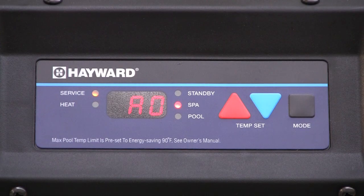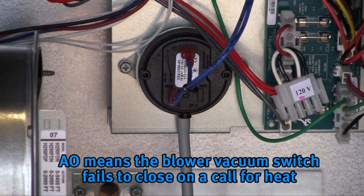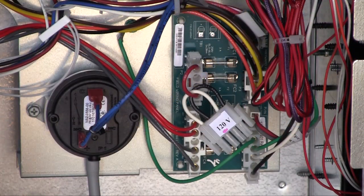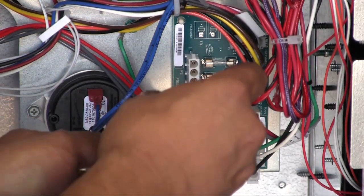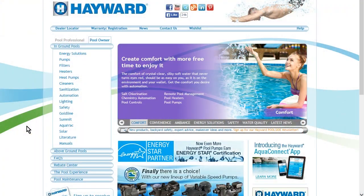The AO code is displayed when the blower vacuum switch fails to close on a call for heat. On new installations, this is sometimes caused by a failure to change the voltage selector plug from 240 volts to 120 volts when the heater is wired for 120-volt operation. Determine if the heater is wired for 120 volts and if so, make sure the 120-volt plug is installed.